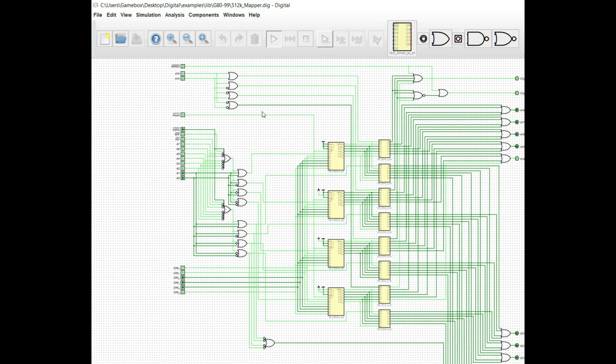Now, we wrote that to the very bottom register, so if we actually put A15 and A14 low, we can see that we have 3 on the, I'll say that's 3. Is that 1, 3? No, I'm sorry. That's actually 2, 3 on the data bus. So we can see that we have 3 right here. And if we actually take into consideration this top bit, that's a 1. That means that when we go to cycle this on the memory request, we should get RAM instead of ROM.